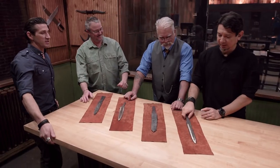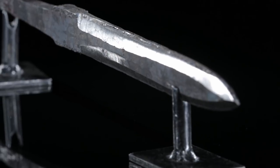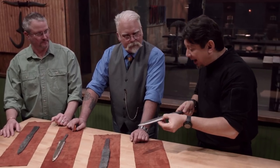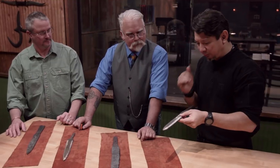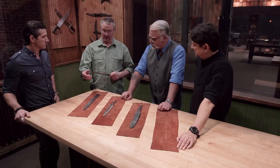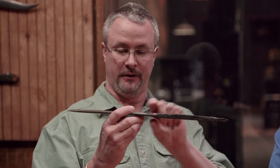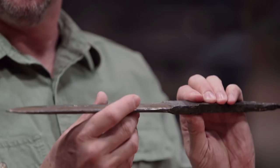Doug, why don't you go ahead and start with Don's blade? The solid piece looks like a dagger. It's got the hidden tang we asked for. I don't see a lot of laminations or forge scales compared to the others, except on the tang right here. Don's is definitely the cleanest of all of them, and it's quenched — that's an important thing. He's got a lot of material; this is super thick all the way down. But forge thick, grind thin, especially if it's something they're sketchy on. So he's got a lot to work with.